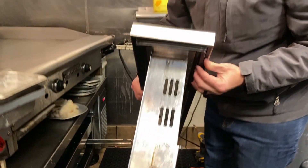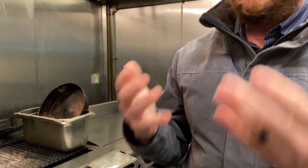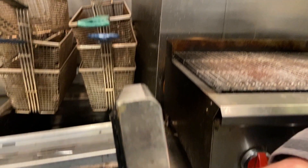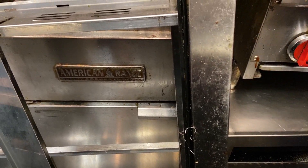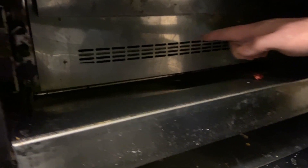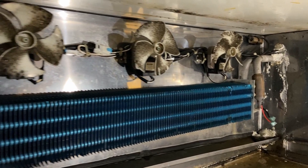One of the things you really need to be doing in the kitchen is wearing gloves - I have bad habits about not wearing gloves, it's my worst issue. All this stuff here has food sitting there - it gets gummed up and dirty. These are things that should be required maintenance for the restaurant but oftentimes they're not. Behind that panel right there is our evaporator, and that's where the leak is. The fins are dirty and we're going to have to clean them.